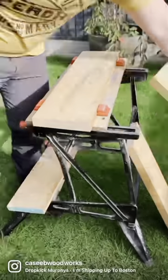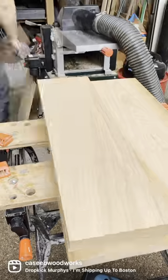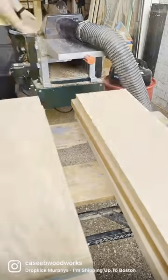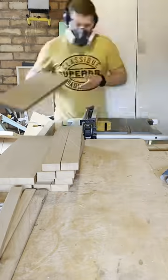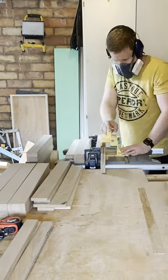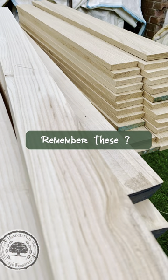Here's an image of the basic cot ends with the tapered legs. We were now ready to make some panels, so I started out with some rough sawn timber, cut it roughly to size just so it's easier to pass through the planer. I planed one face first and then ran it through the thickness planer one by one to get a more consistent size and thickness. I then started breaking down those boards into smaller pieces to the correct panel widths, then split it all to get the correct thickness using my Micro Jig push block.